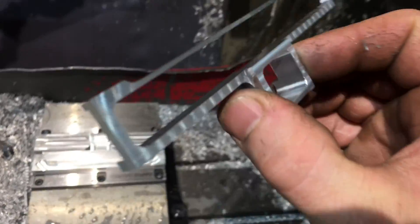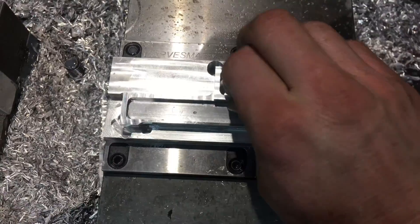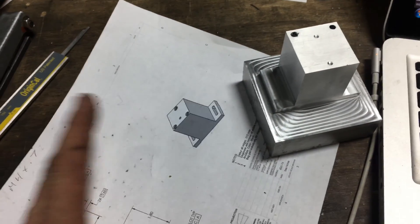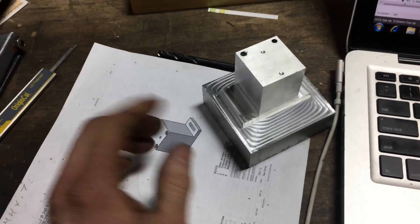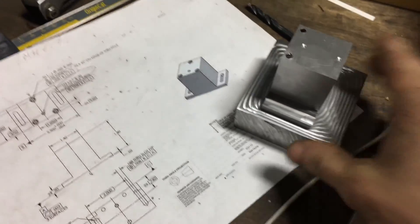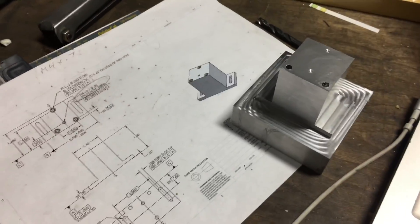This little guy right here is the toughest little part I have ever made, and the crazy thing is it's not done yet — it still has two ops to go. It's a very simple-looking part, but when I was cutting my first attempt I broke a drill bit. It's a very deep hole, about two inches deep, and when you're drilling deep holes you can't really run with the same speeds and feeds. I broke a drill bit inside the hole and had to start over. It seems like every time I go to make a new part, it takes at least two tries.